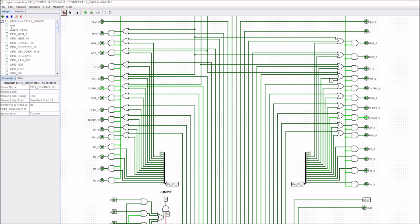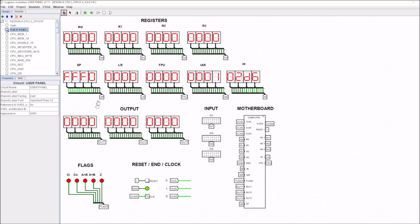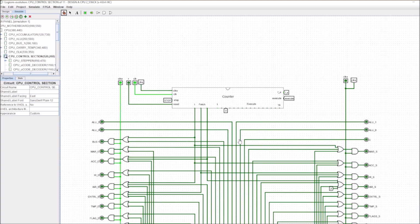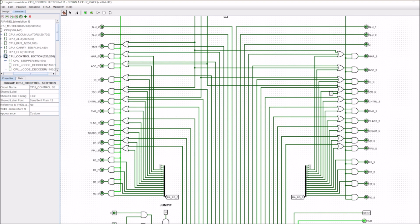So if I continue with this, you'll just see that it works through the process here. It's stuck F0 into the stack pointer, so that sets up the stack. It then goes to the jump command. The jump command pulls out address 8000. It jumps to the ROM, and the ROM has just got the end command, which is just 70. So it's not doing very much, but it just shows that these are the ones I've worked through so far and coded in. So I'll work through the rest of the values within the spreadsheet, and I'll generate the rest of the opcodes that we require. And it makes it an awful lot easier using this generalized control unit in order to generate whatever opcodes we happen to want.